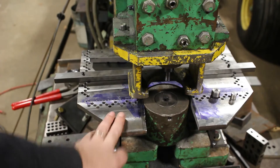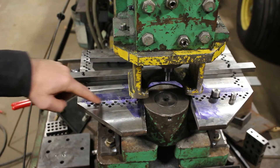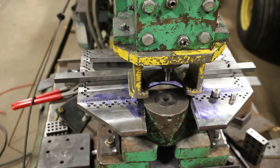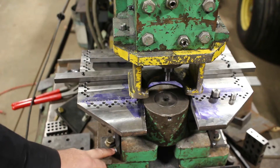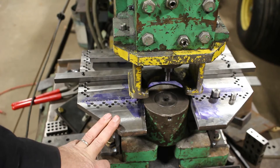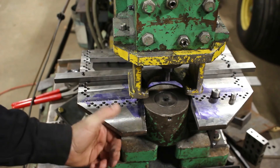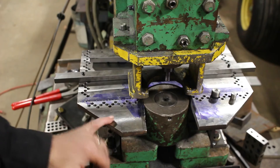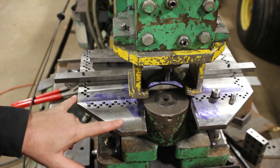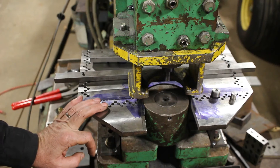I did film some video of me making this, but it's really pretty tedious because there's a gazillion holes — I forget how many but there's a ton. I also scribed measurement lines along the back and on this side so you can get a reference. I still need to take this off and finish welding the little stands that hold it up off the table. You might be wondering why the corners are cut off — the plate of steel I started with had one corner cut off, so I cut the other to match. I'd probably trim the corners a little bit in the future, but I would not cut off this much if I was making this again.